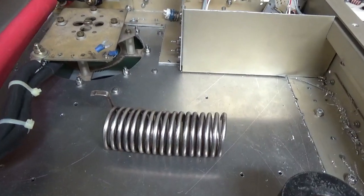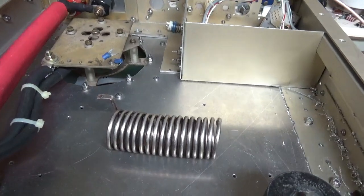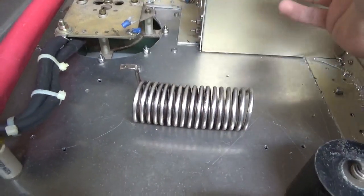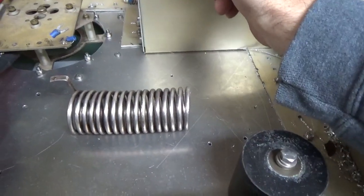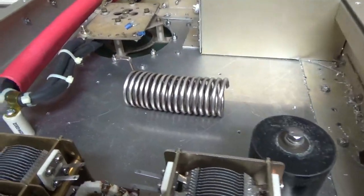Same size plate supply, just more voltage because I don't have to worry about the internal capacitance like I did with the other amp. The higher frequency needs less capacitance on the plate side, so the output network won't be an L-Pi — multiband obviously. But a lot of the same stuff from the other one going into this one.